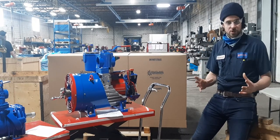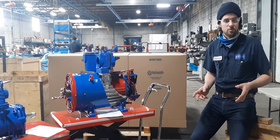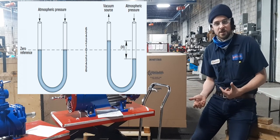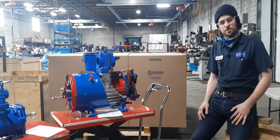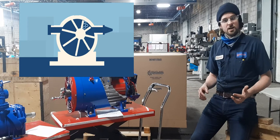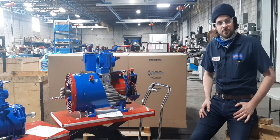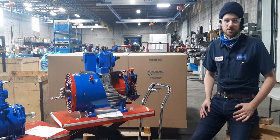Really what we're talking about is pressure. When the pressure inside a vessel is less than the atmosphere, it will pull things like air and matter into it. And when the pressure inside a vessel is more than the atmosphere, it will push things like air and matter out of it. A vacuum pump creates both positive and negative pressure when it operates. So depending on the design of the pump, the tanks, and the hoses, we can use either the push or the pull of this. The pump doesn't care if it's pushing or pulling, because it does both whenever it's operating.